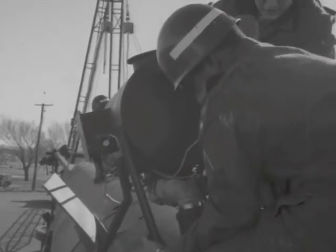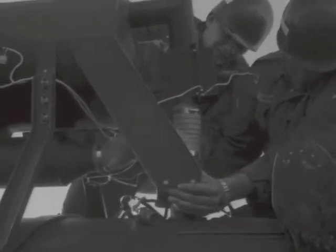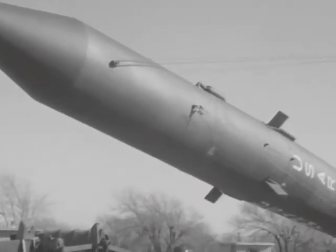The crew is attaching the external heating and cooling drop tank to the side of the instrument compartment. The drop tank maintained a constant temperature inside the instrument compartment prior to launch. The tank contained dry ice for cooling air and had electrical heater circuits to provide warm air. The tank was jettisoned just prior to rocket engine ignition.